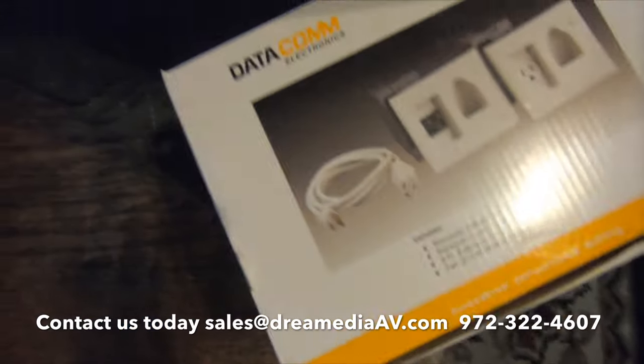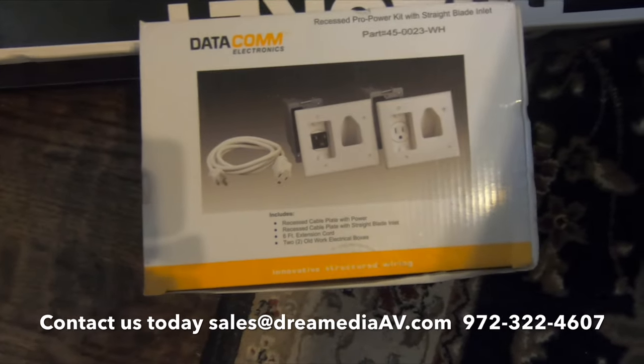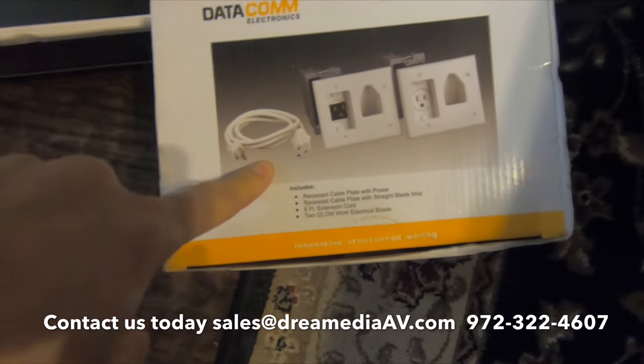This is the tilt 3780S, and we're going to be using the Datacom power outlet extension, which basically allows us to plug into the existing home's electrical system. We're going to mount into the studs, cut a hole in the sheetrock up here and another hole down below, and all the wires will pass through to the devices. We're running two HDMIs today — one for the cable and one as a spare for future devices.